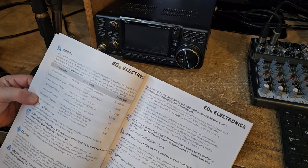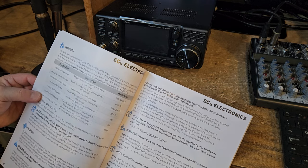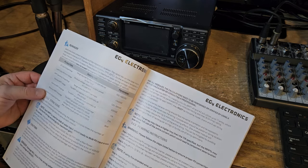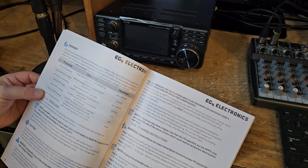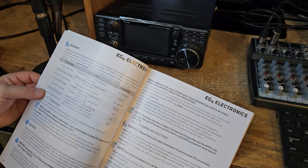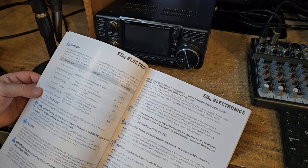Reminder, verify the lowest ambient temperature of the installed location and the rated VOC of the solar module nameplate, obtained by blah, blah, blah. Now, DC input voltage range 100 to 480. Load output minimum voltage 140. MPP operating voltage range 120 to 385. Nominal MPPT voltage 320 volts. Nominal amperage 17, maximum 25. Maximum utilized solar power 8 kilowatts.